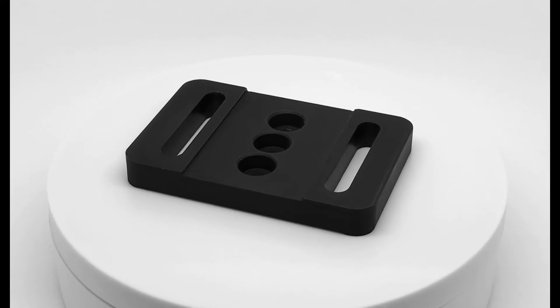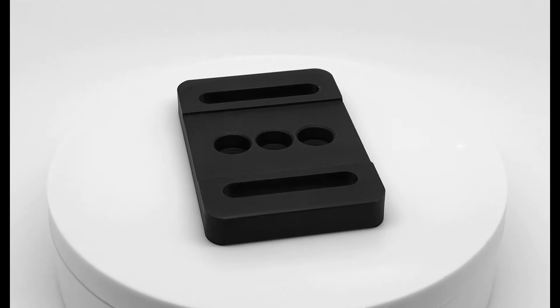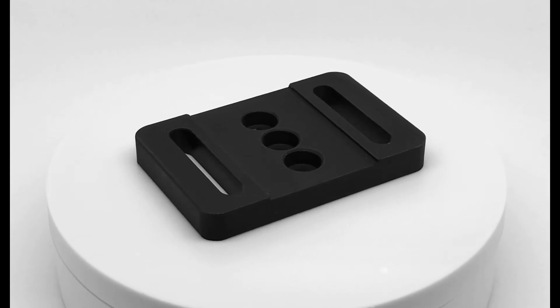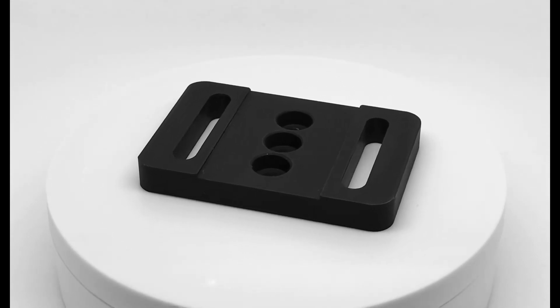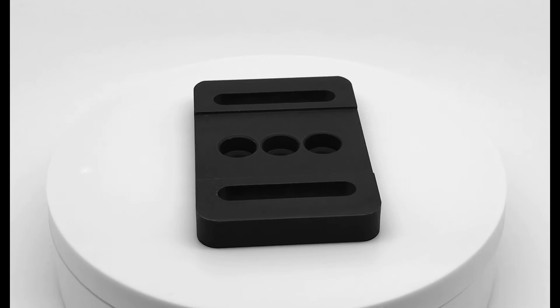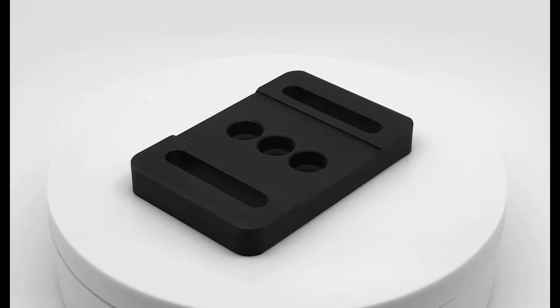Next is the B2X3 or B50X75-M mounting base, a larger version of the BAS002 mounting base. This baseplate has dimensions of 2 by 3 inches or 50 by 75 millimeters. It has 3 counterbore clearance holes for 1/4-20 or M6 cap screws to be inserted. Additionally, 2 clearance slots are also provided to allow easy mounting to the surface. This baseplate is compatible with imperial and metric tables, posts, and post holders.